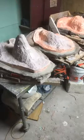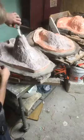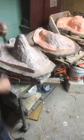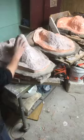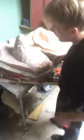I don't like this chunk here because my silicone is going to catch on it. So I'm just going to get rid of it in Bondo here and then add a little more Bondo because I'm going to do some anyway. I got a little cracking from shifting, but it's not going to affect me any. So I'm just trimming it up. As a beauty coat, it's real thin. It just makes a beauty coat.